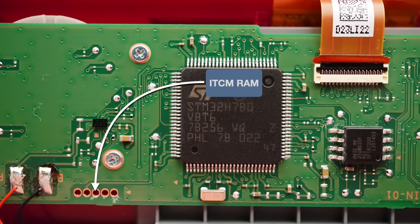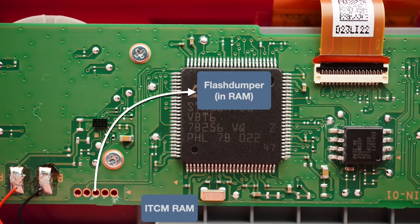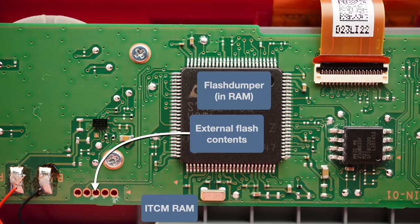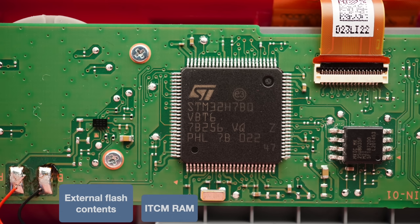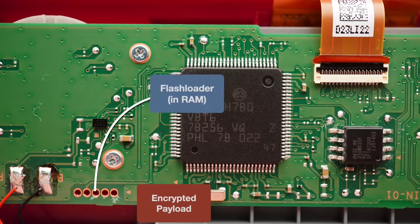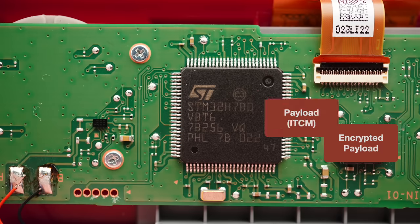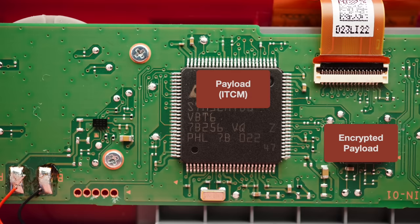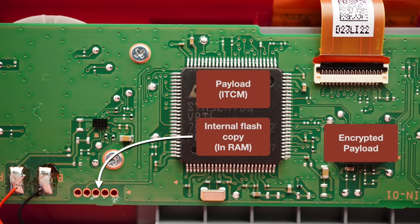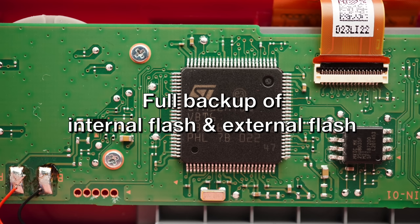This is exactly what our backup scripts do. We use OpenOCD to dump the contents of the ITCM, which — because it's RAM — is readable even though the device is running in read protection level 1. Then we copy a piece of code to RAM called FlashDumper, which copies the contents of the external SPI flash into RAM. We dump those RAM contents using OpenOCD, giving us the encrypted SPI flash contents. Using the external flash contents and the ITCM contents, we can encrypt our own payload. Next we copy another small tool called FlashLoader to RAM, which writes our encrypted payload into the external flash. When we reboot the device, the firmware will decrypt our payload and copy it into ITCM-RAM. As soon as our payload gets called, we get a copy of the STM32's internal flash in RAM, which we then dump using the debugger. Now we have a full backup: the SPI flash contents and the internal firmware, so even if we unlock the processor — which will cause a mass erase — we can always go back to the original firmware.